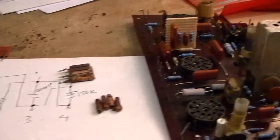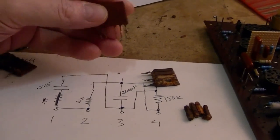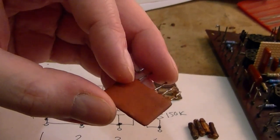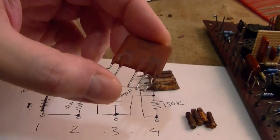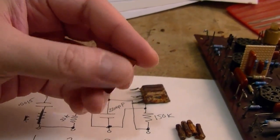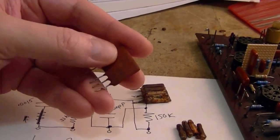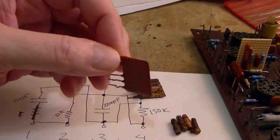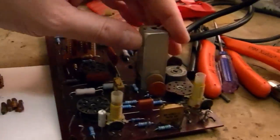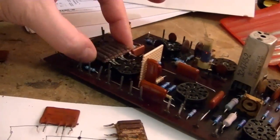It also got me thinking about why did they use these in the first place. I can think of a few possibilities. For example, in modern circuitry, you might see these if they're really high frequency, because they can lay out precise, very small components on a little module like this and then seal them all up. Two could be for RF shielding, if underneath this coating there was, say, a metal shield all around in here. Another possibility is thermal tracking, because this whole module will pretty much stay at the same temperature and all the components will be heated evenly. And finally, just to save space. These cabinets and projectors were pretty constrained for space, so mounting a few components vertically like so takes up less space than horizontally.